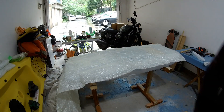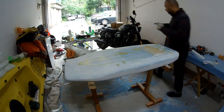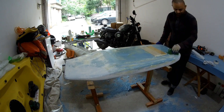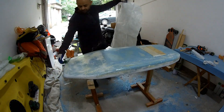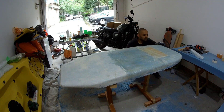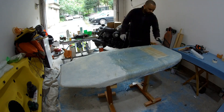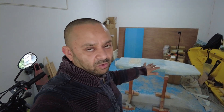I went with a thicker fiberglass felt because it gets soft very easily and is easy to form around corners. I then poured thicker epoxy generously on the bottom part, spread it all over, gave it a little time, and put the fiberglass felt on top. Once again I went generous with more epoxy and put the corners down nicely and shaped it on top of the board. The two colors are just part of my experiment with two different epoxies, which I will share with you.